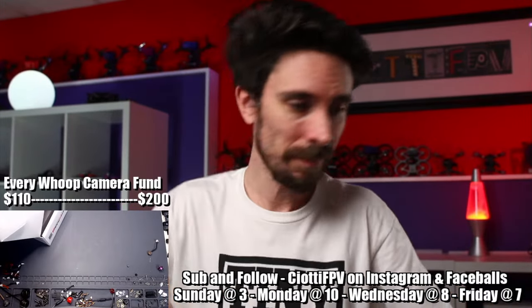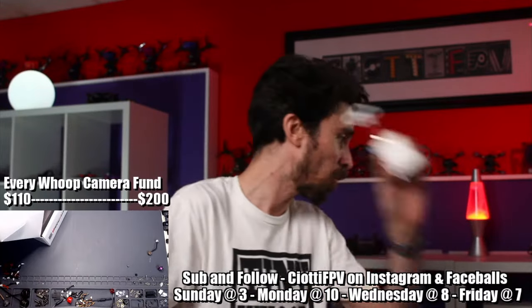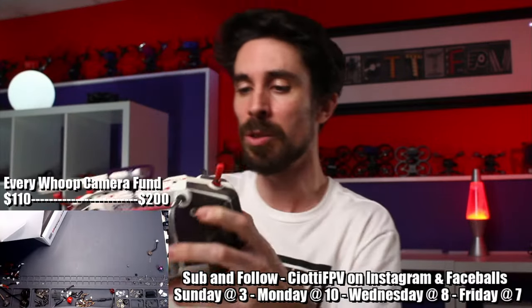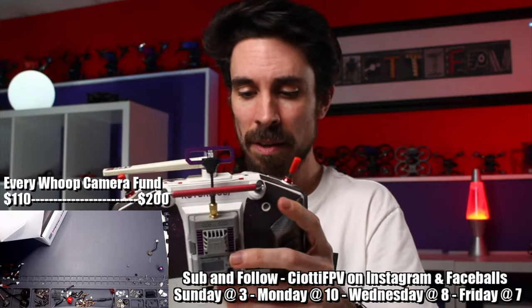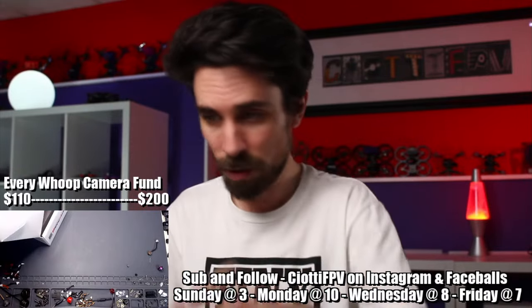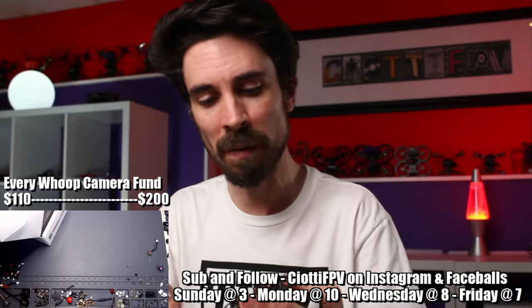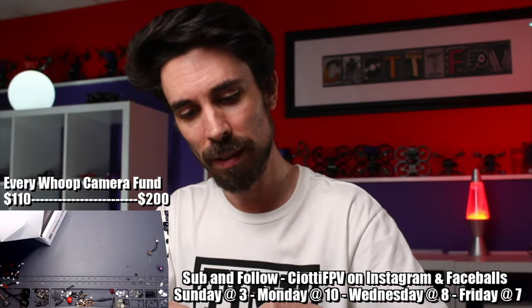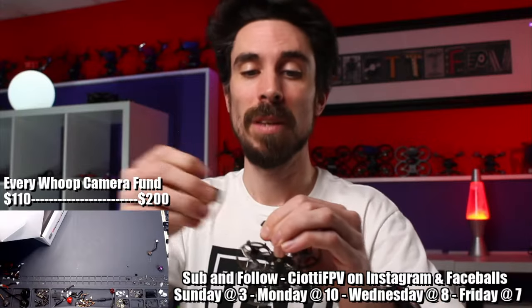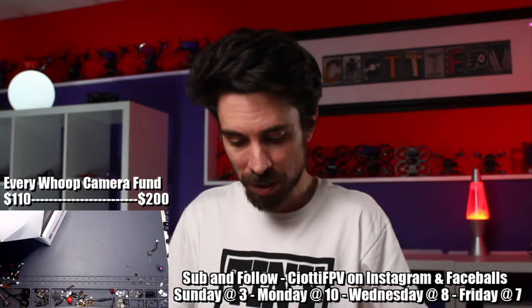Let's see if we can get it bound. So I'm going to assume, like I said earlier, that it's on ELRS 3.0, so I'm going to take the module that I've got with 2.5 out and put the 3.0 module in. Fire the transmitter up. And all right, we're going to run a little bit of an older battery here initially. And so we're going to plug it in 3 times. Once, twice, 3 times. That should put ELRS into binding mode.